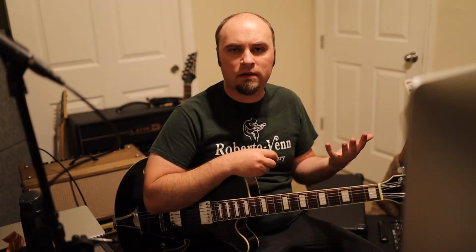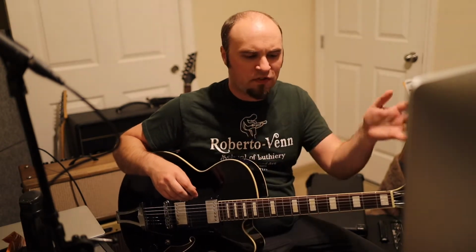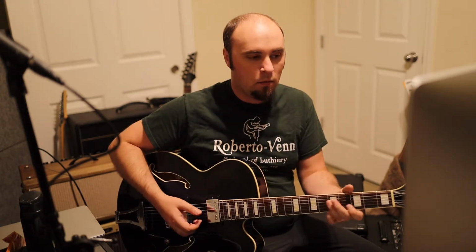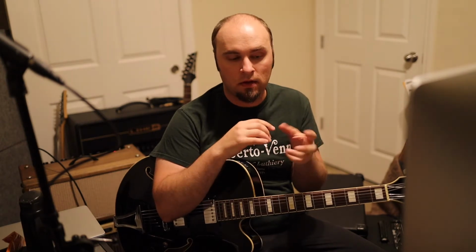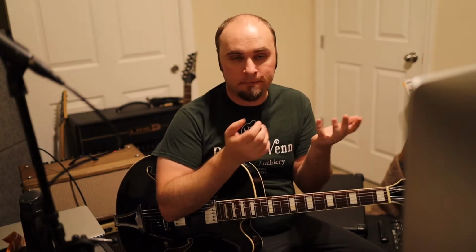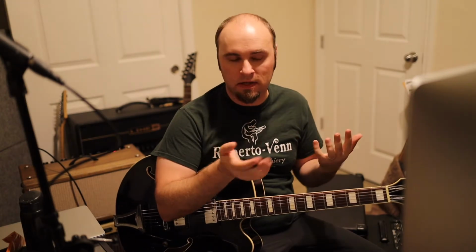Was it Edison? Edison figured out that AC current would go much further, or was it Alexander Graham Bell? Whatever. Whoever figured it out, you can look it up in Google. It'll go much farther. It has a higher power retention rate. It's the same kind of thing in amps. When I utilize power tubes in that same way, when it's not just on pushing power out all the time and the tubes are actually going back and forth, you can increase the amount of voltage that they can handle because they're not running at full out the whole time. So if a tube is designed maybe for a 5 watt output, when I put it into an AB design, it can actually push up to 15 watts maybe, or 20 watts. It just depends on the type of tubes that you're utilizing.